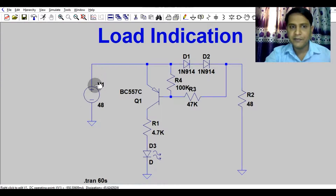You have a power supply of 48V, and R2 is your load at 48 ohms. When this load is connected to your power supply, the LED should glow. When your load is disconnected, the LED will be off. The emitter is connected to the power source at 48V — this is a PNP transistor, BC557.